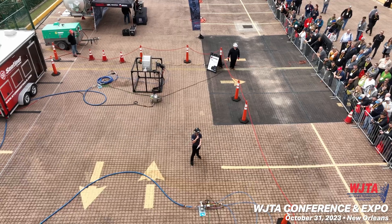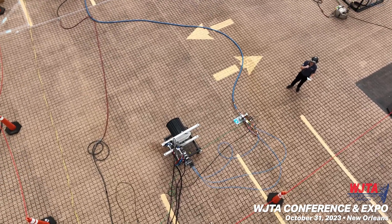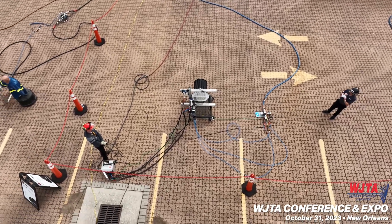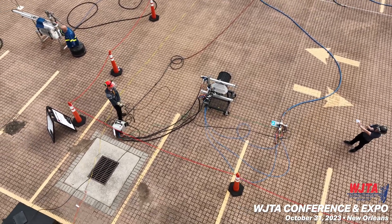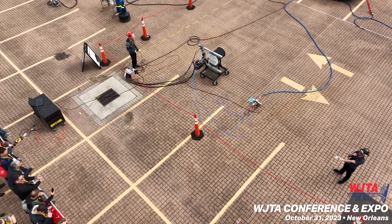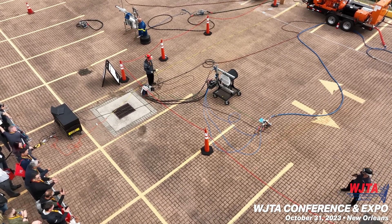What you see is an XY frame — we're moving linearly across rows and dropping to another. What Dan's going to start doing here with the Sentinel technology and our operating system 2.0 version of embedded software is teaching the machine the pitch and pattern. On that bottom half of this exchanger, you'll see a rotated triangular tube pitch, and Dan's going to go ahead in learning mode and start to teach the machine what he has there.